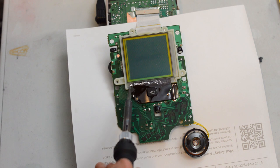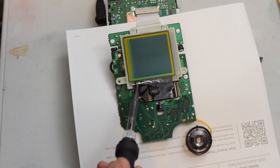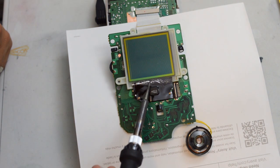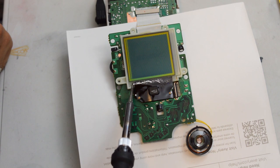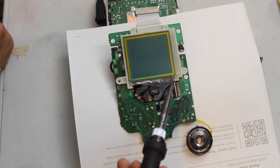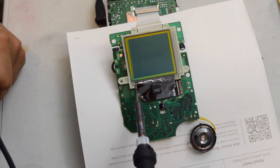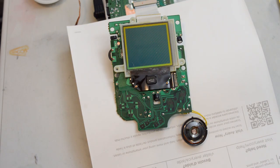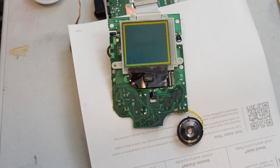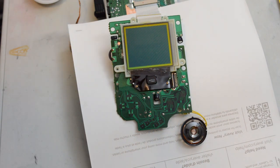We're going to clean it up later with a wick. The residue basically means my soldering iron wasn't warm enough yet, which is why the solder started sticking to the ribbon rather than staying on the iron. At the edge it's always a little tough. Work like that until you're sure all your lines are working consistently. Now that the iron is hot enough, I was able to clean off the solder really easily. A little residue left at the end is not a problem — it'll actually help if you ever need to go back in. As you can see, our screen is now fully dark left to right, no more lines — the screen is in perfect shape.